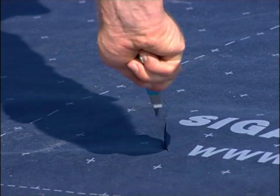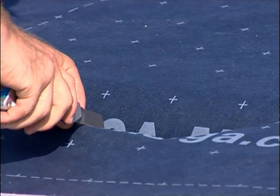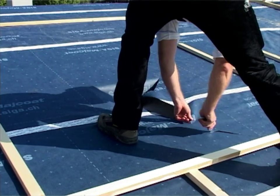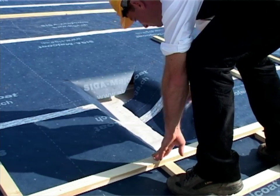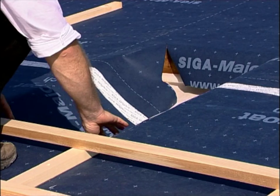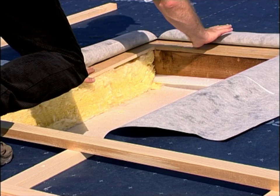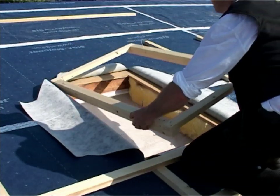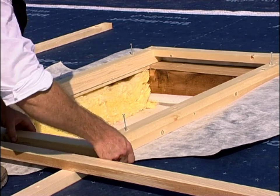In order to install the Skylight joint, cut the breathable membrane to fit the mounting frame using a Y-cut. Fold the sides back. Pass in the mounting frame. Make sure to observe the instructions of the Skylight manufacturer.